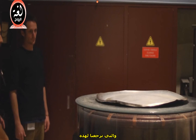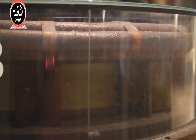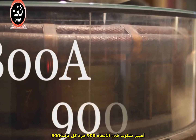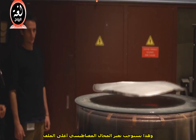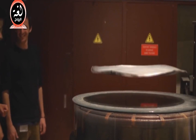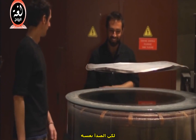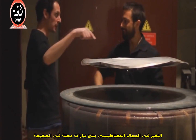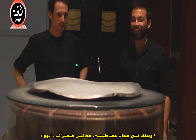Which brings us back to this. Through the bottom coil, we are passing a huge electric current — 800 amps — which alternates in direction 900 times per second. This ensures there will always be a changing magnetic field above the coil. Instead of a second coil, we're using the aluminum plate, but the principle is the same. The changing magnetic field induces currents in the plate that create an opposing magnetic field, so it levitates.